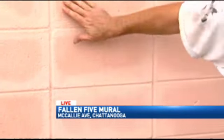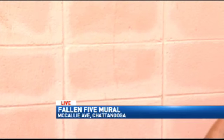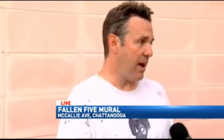We'll put two thick coats of primer to help fill all the little nooks and crannies, make it easier to paint on. But the idea is, if you've got a good base and a good substrate, this mural could last 25, 35 years.